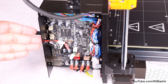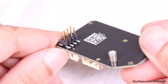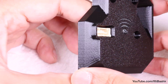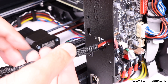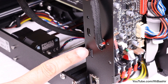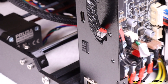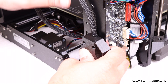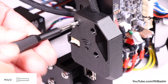Time to neaten and finish up with the board now, so reach for the small wireless module, taking care to handle from the edges and not bend those pins, and place it inside the Wi-Fi cover, with the connector fitting down into the respective hole, taking care not to bend or damage the pins. We need to use this to cover the opening where we inserted the heat bed cables, with the cable bundle facing upwards and fitting neatly into the groove within the Wi-Fi cover. At the same time, the pins must connect into the electronics board just here, so attach the module and cover as straight as possible while angling the heat bed cable bundle upwards, taking care not to bend those pins, while securing into position using three M3 by 12 screws.